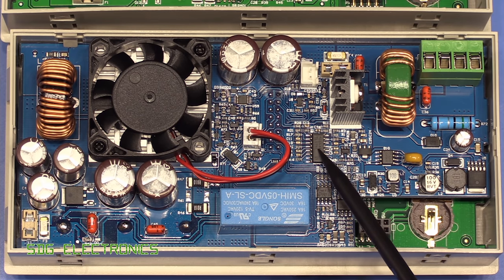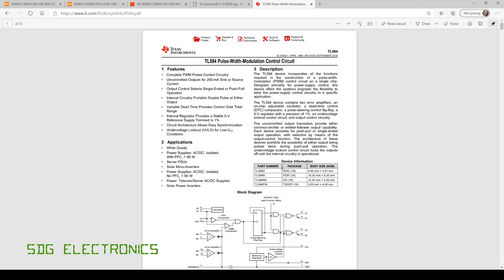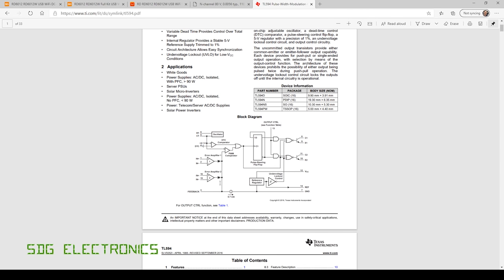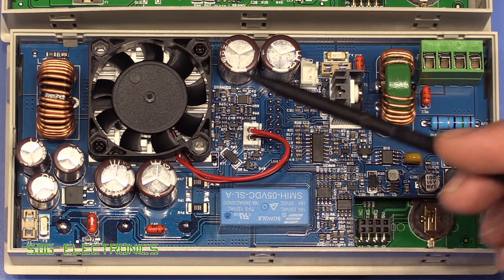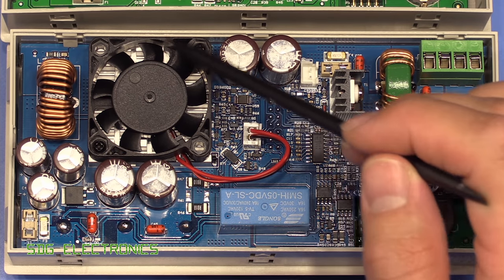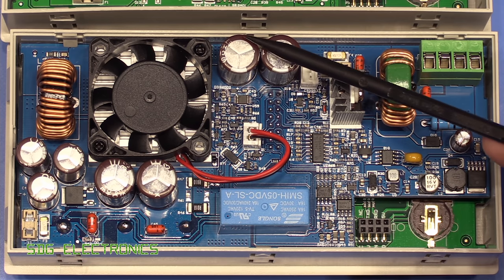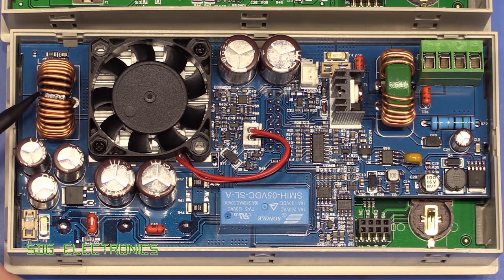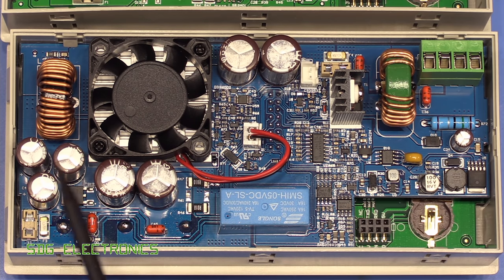We've got the same TL594 PWM controller chip, which is a general purpose PWM controller. The MOSFETs for this are external, so it has all the electronics required for PWM control but no power electronics integrated — that's the rest of the stuff on this PCB. The power MOSFETs are sitting underneath the fan-cooled heatsink. There are more capacitors for smoothing and a bigger inductor, as this operates as a buck converter where the input supply has to be higher than the output voltage. Everything has just been uprated for the extra current.